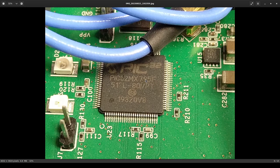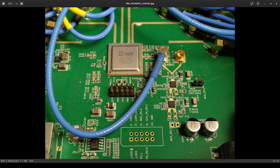The PIC32 also runs the Ethernet interface. Towards the center of the instrument, we have the meat of the entire device — an InPhi 100 gigabit Ethernet PHY that is used to both generate and receive all of the high-speed signals. We can see some of the differential pairs coming out on the top layer and a few routed on the back layer, with fencing vias along the edges.